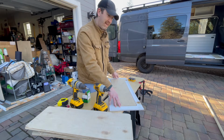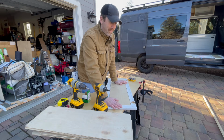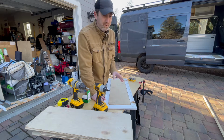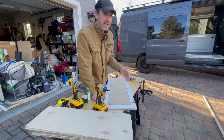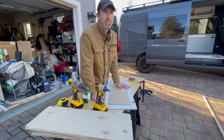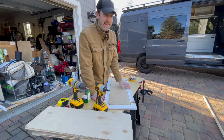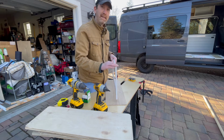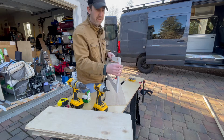One of the difficulties I've had in this process with these cabinet doors is that I chose, of course, to not buy one, and also I chose to not make it the standard way. Typically, you end up using 3/4 inch. That's what's standard for cabinet doors. If you buy 1 inch plywood or any kind of birch wood, it actually comes out to about 3/4 inch. And mine, as I mentioned previously, is only a 1/2 inch. It's really light as well, but solid pine, so that I can screw things into it and bore holes out without an issue.